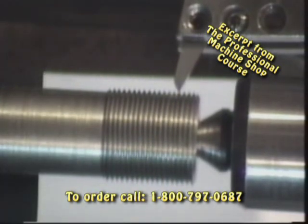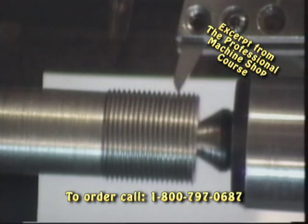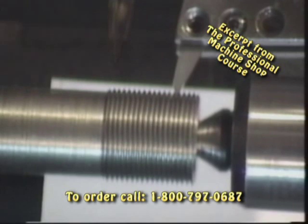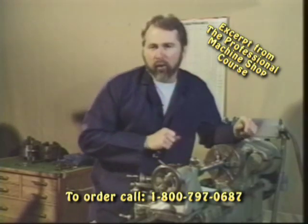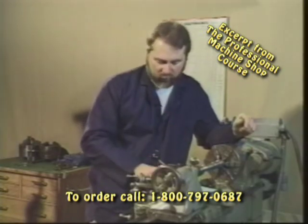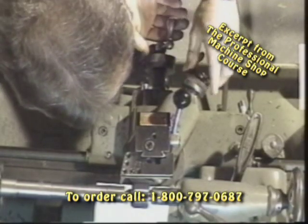You can see that the cutting tool is right on the top or crest of the thread. So if we were to advance the cross feed, we would simply cut right on the crown. We're going to make a minor adjustment with the compound, and by using the compound rest and the cross feed, we're simply going to guide the threading tool right into the depth of our V-thread. I like using a three by five index card underneath the workpiece — this allows perfect clarity and contrast so we can get an excellent view of the cutting tool mating into the specific V-thread.